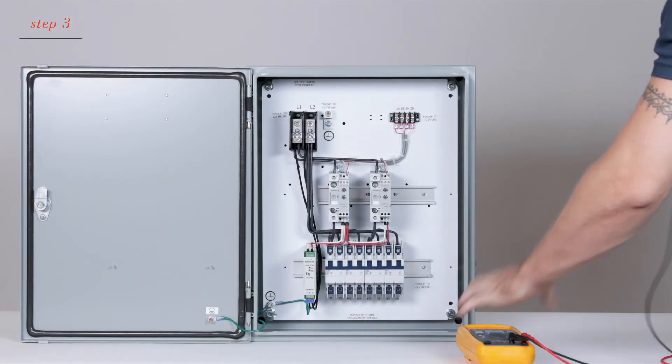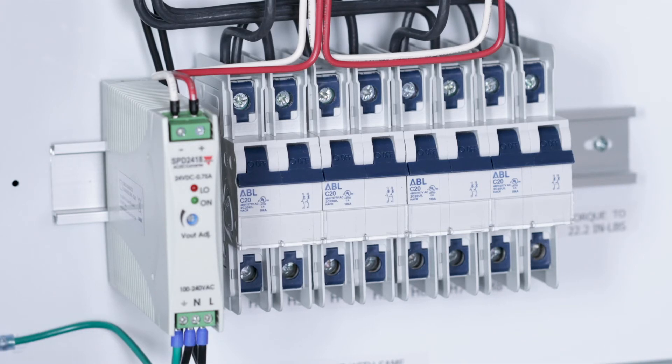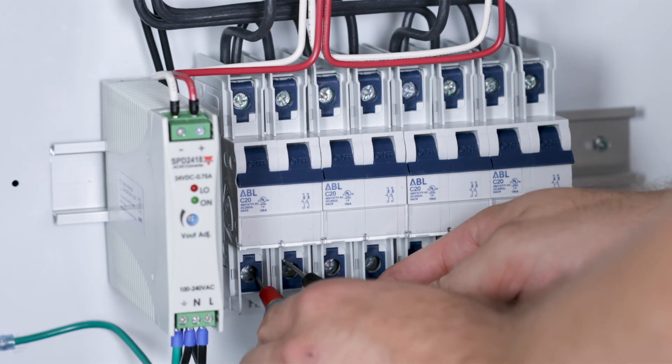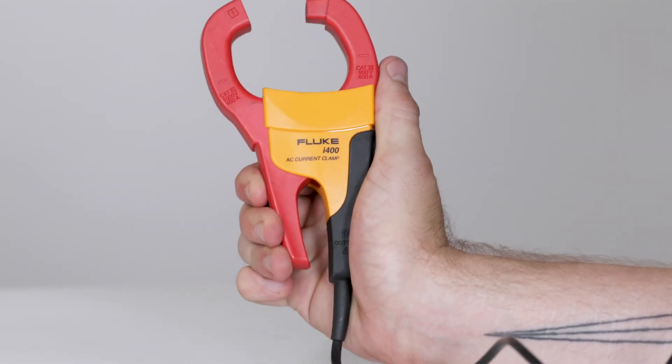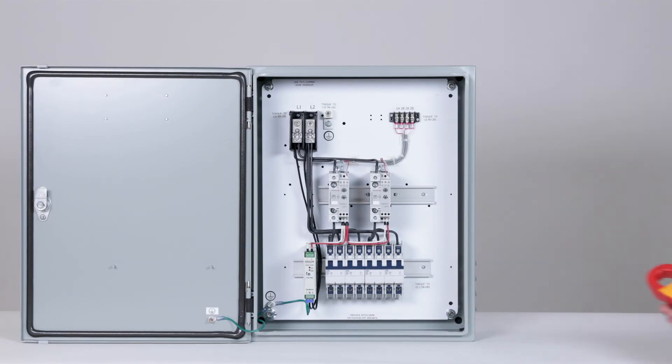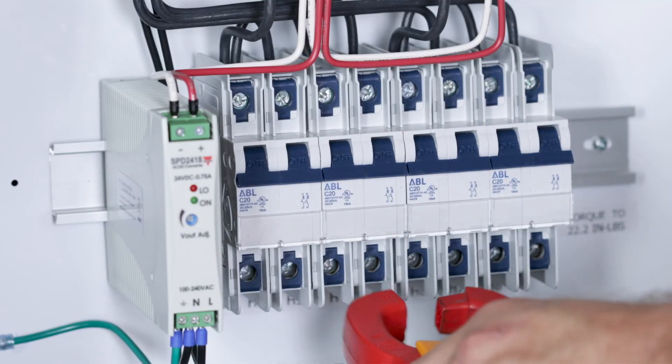Now check to see if there is main feed AC voltage at the output of the breakers. You will take measurements between H1, H2, etc. You will see this at the bottom of the panel. Verify if the heater is pulling the specified amperage. You'll need to take the readings using an amp clamp at the output of the breaker associated with the heater, found at the bottom of the panel.